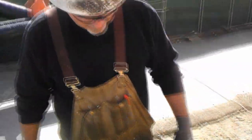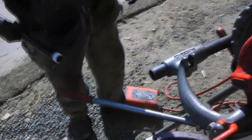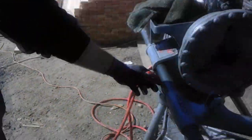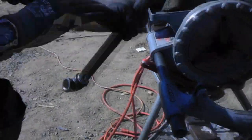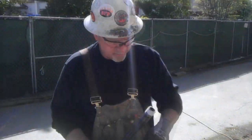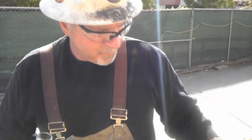Always want to make sure you have your safety pedal on the machine — the machines are extremely powerful. A lot of guys cut this switch off out of convenience and use the on-off switch. But if you get something locked up, your gloves get caught, you have no way of shutting it off, and it will tear your fingers off. Always maintain your safety pedal and keep your hands clear of the moving parts.